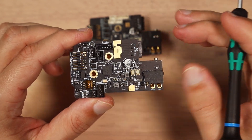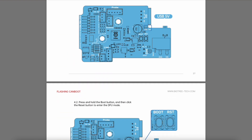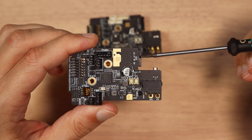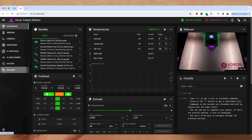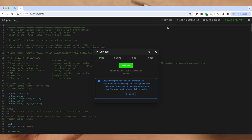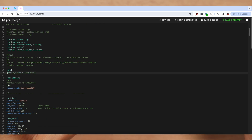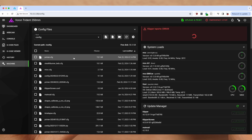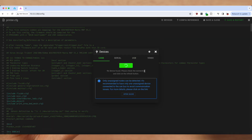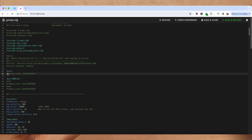I've spent some time off camera and prepared this board. There is very good documentation on how to flash new firmware on this board. Just make sure that your motherboard and toolhead board have the same firmware installed. Also, I have noticed that if you already have a CAN bus ID and you put it in your config, your motherboard will be able to connect to it and you'll no longer see it in the list of available CAN bus devices. To retrieve the list of CAN bus IDs, I usually comment out all usage of other CAN bus IDs in my settings, because when the CAN bus connection is open, devices will not be listed — and that might create extra pain when you want to retrieve that ID to flash or configure the board.